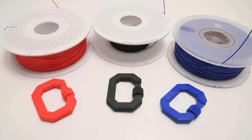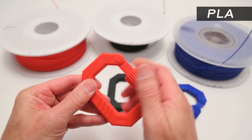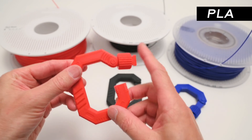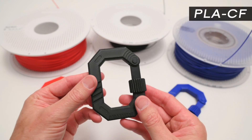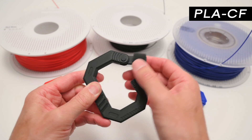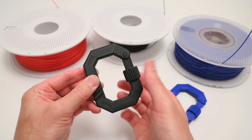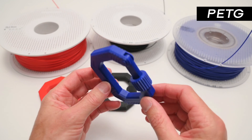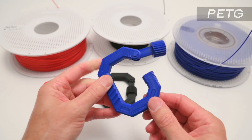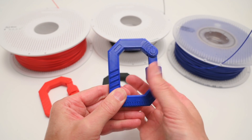The next prints are three screw lock carabiners printed with a variety of materials. The red one is printed with PLA, a basic material designed for easy printing and one of the most common materials used in 3D printing. The black one is printed with PLA carbon fibre, a carbon fibre reinforced PLA that gives improved stiffness and strength — it printed easily and gave a nice matte finish. The blue one is printed in PETG, a long lasting and durable material with excellent impact and water resistance, good for durable parts. All the finished prints have excellent clean and detailed print quality, and the X1C handled a variety of materials with ease.